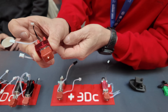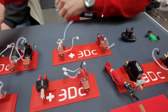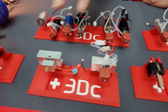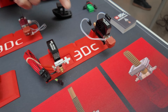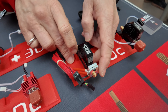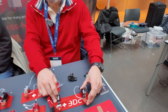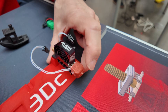That is a very quick tool-free nozzle change. They're making this for all types: E3D, Creality, Voron, the S1, and the Prusa Mini as a drop-in replacement with the same length. The benefit is a 12.7mm nozzle melt zone giving about 12.5 cubic millimeter per second maximum.